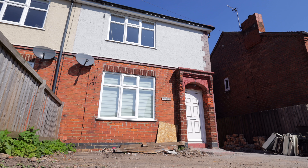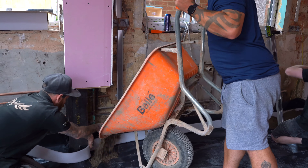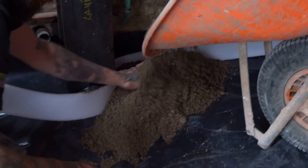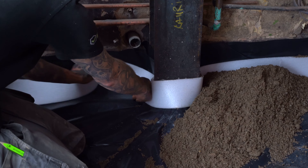So what we're doing here is just basically spotting some screed. This is helping support our expansion membrane. You want this around the edge of your screed because naturally there's movement and you don't want it popping, so you put this around the edges.